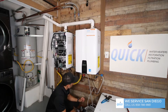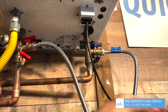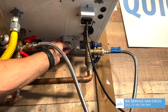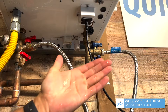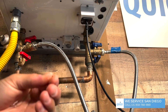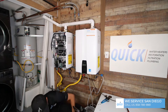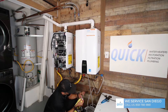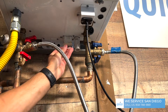While your unit is flushing, you're also going to want to clean out what's called the dirt trap. Just pull this little two-pointed pin out, gently pull down, and you'll see all sorts of junk stuck in here — pieces of shavings from what looks like a drain, little pieces of metal. Clean that out, wipe it with a rag, and make sure to keep the silicone lube that's on there. Go ahead and apply a little more silicone lube, then put it back in and it's clean and ready to go.